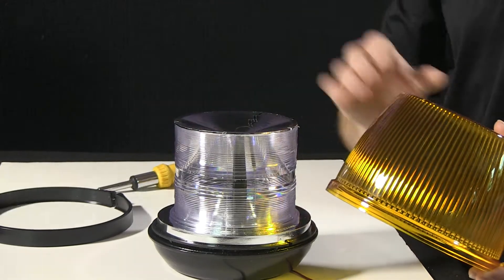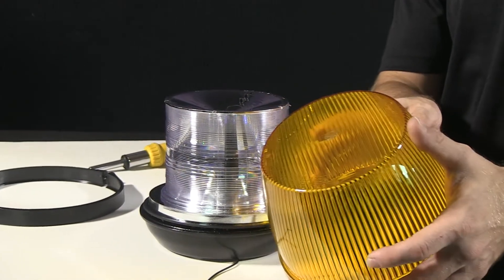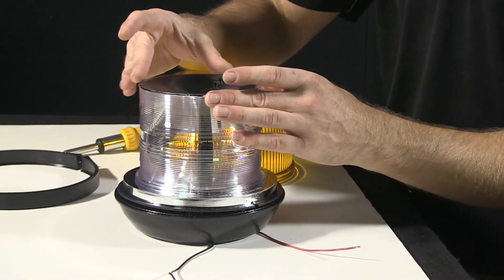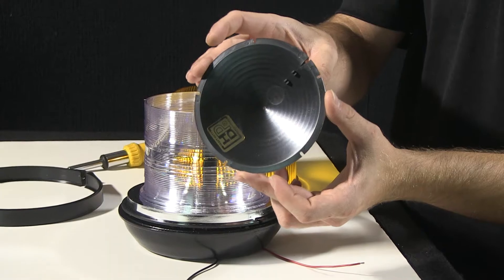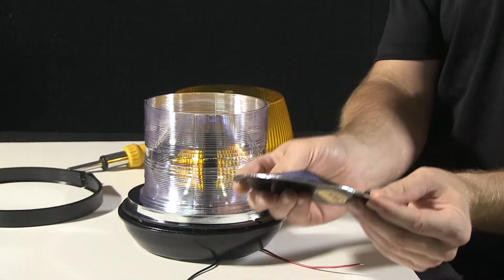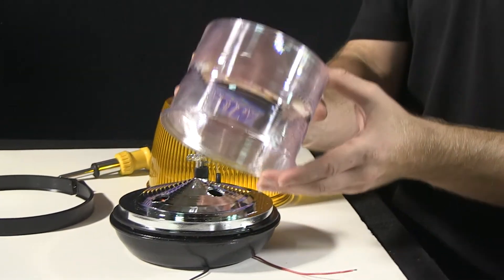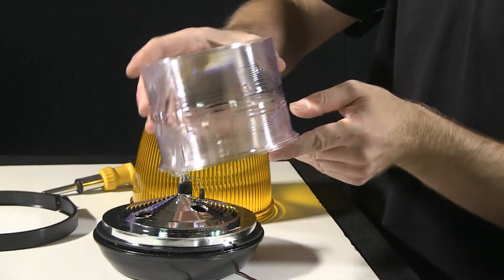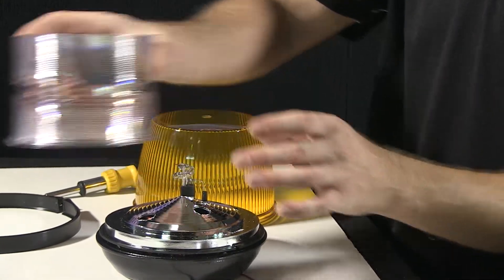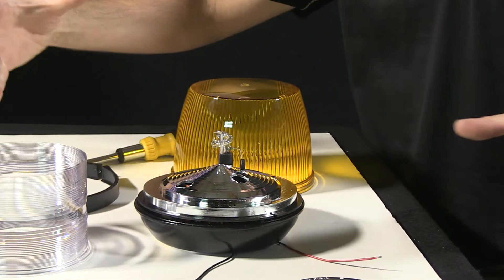The S360 is made up of a series of components inside here. You have an outside optic dome, an inner cover that's polished and dimpled inside, and another clear optic filter. You can see here the optics go from a tighter weave to a wider weave, and that's to help with the center strobe light dispersion.